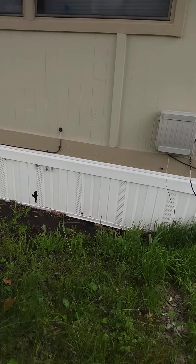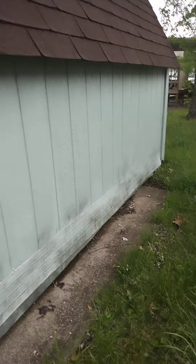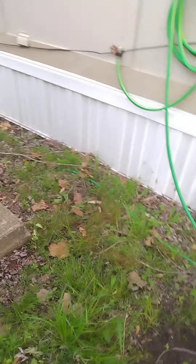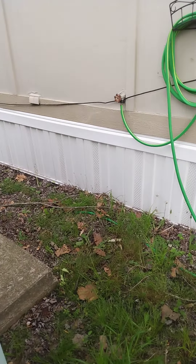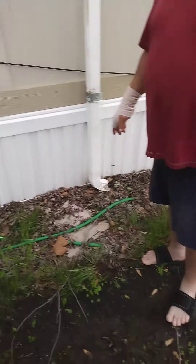There's power in the shed — did you look in there? I don't see where it's coming from; they probably buried it. They had to have buried it, or they used to have power. There is a wire going into it — they used unshielded wire and buried it, going straight under and over. That's not up to code — not the proper shielding. But you could put that in a piece of pipe and that'd be fine, because it's just one circuit going to the shed — probably just a light and a plug. If we dug that up, I'd just put a piece of PVC from there to there, and that'll save you a ton of money.